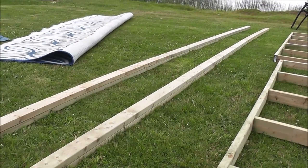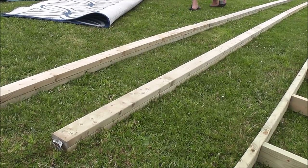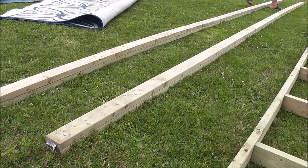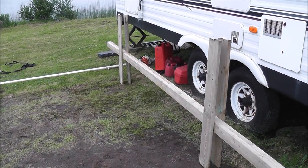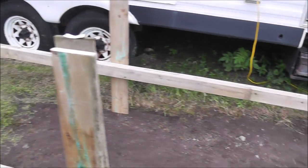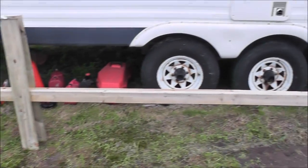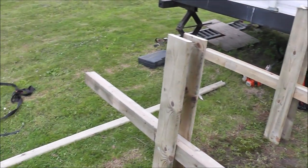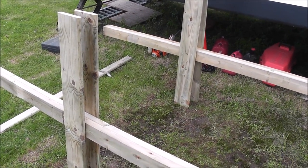Two beams complete. Each beam is a two by four which consists of two twelve footers and two eight footers nailed together. So we're just leveling off our beam here. We place this tentatively about two feet from the trailer, and the next cross beam is four feet apart.